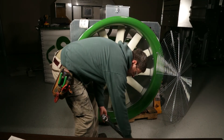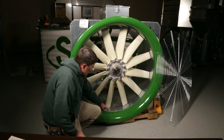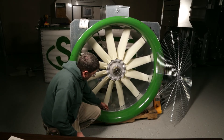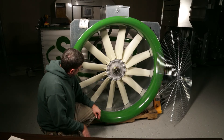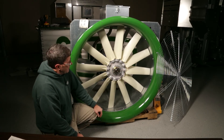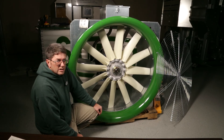The final steps: once it is installed, look for the huck bolts and flex that blade out to make sure it is going to clear the huck bolts — the last thing you want is to fire it up and have that blade hitting those huck bolts and tearing up the tips. Once installed and torqued, reinstall the screen and run the fan for at least one minute. Then remove the screen, recheck your torque setting, and you are done reinstalling the blade.